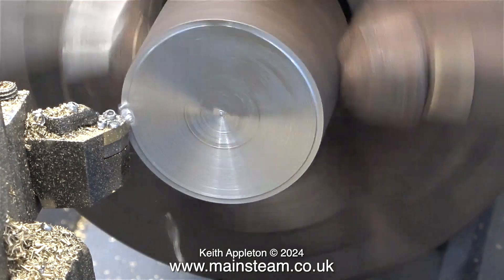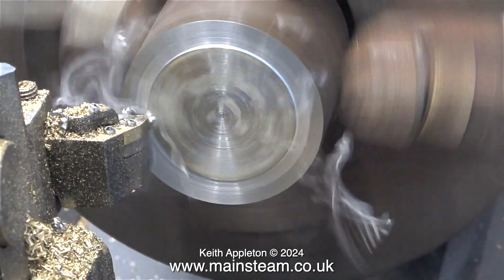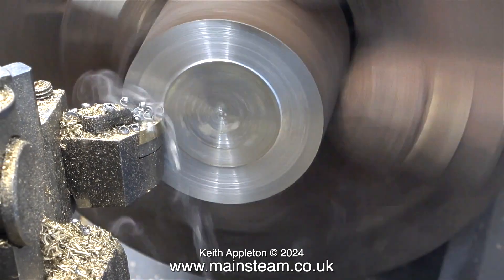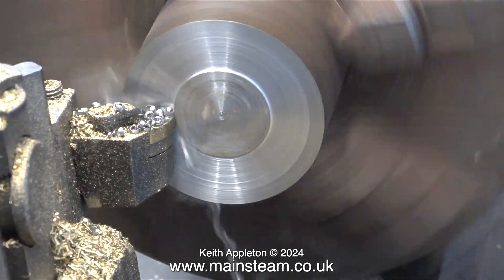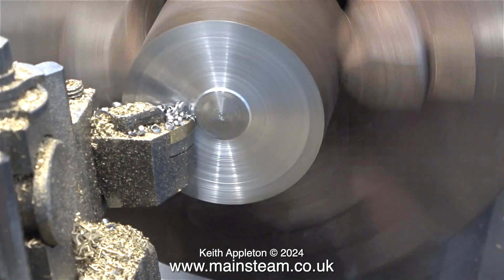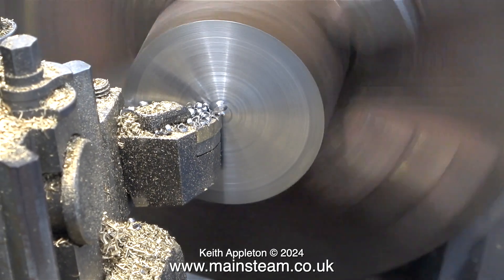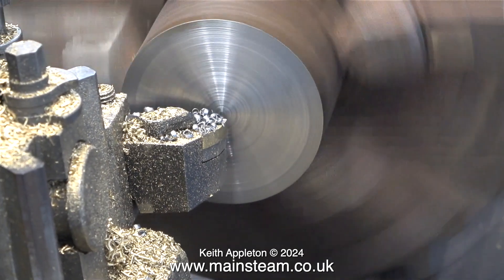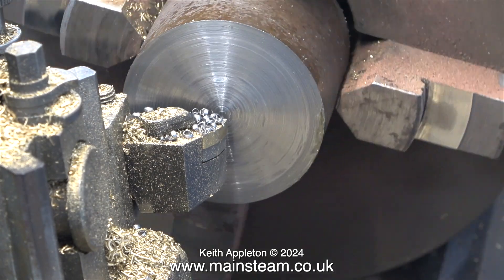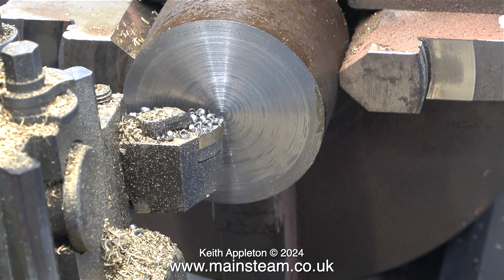To make the job easier to rough turn the piece of steel, I'm using my Smart and Brown lathe, because it has a very large chuck which easily accommodates the diameter of this piece of steel. For viewers thinking they've only got a small Myford — the answer is fairly simple: just fit the external jaws into your Myford chuck and you will be able to hold this satisfactorily. I'm just using my Smart and Brown lathe because it's quicker.